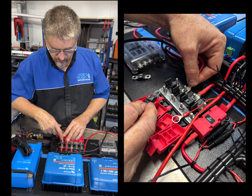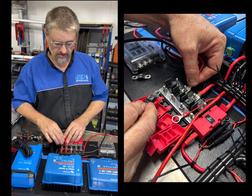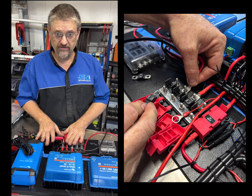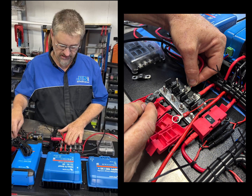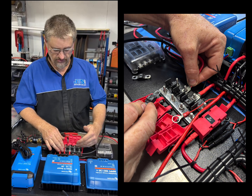On the same run you can also have one that's not through the bus bar and have a separate input going out. So potentially you could have a house battery and start battery breakup, or in this case we've got power coming into a DC-DC and then going out through the bus bar.